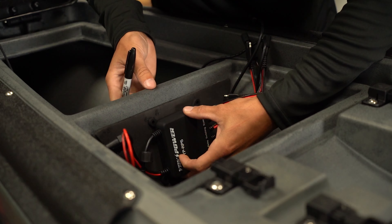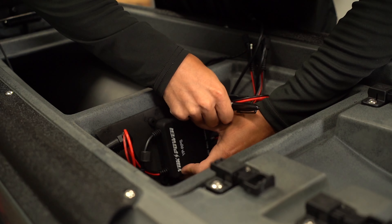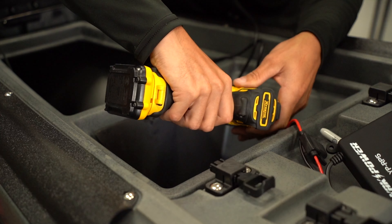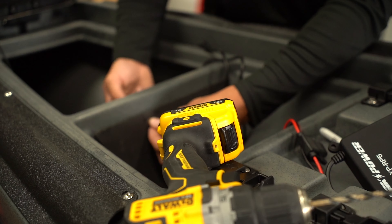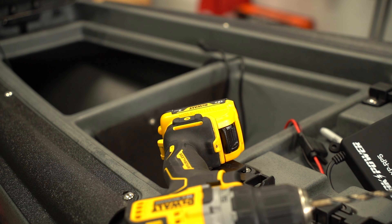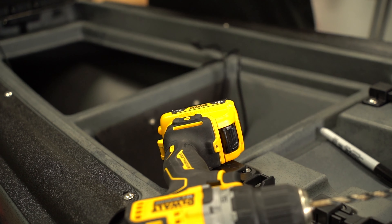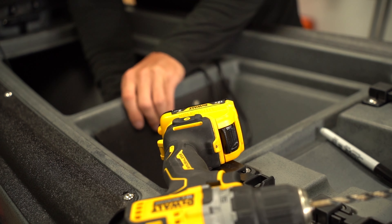Now we're up in the front hatch and I'm laying out where exactly I want this switch panel to go. There was a bit of a challenge here — I wanted the switch panel on the inside to give us enough room for our battery. So I put it on the outside to drill my top two holes, then partially installed the switch panel inside the boat to see where I needed to put my bottom two holes. Then I drilled those out and tied everything together with 10-24 hardware. This gives us a super clean install — we're able to hide the wires inside the hole and have plenty of room for our battery to fit in that recessed hatch at the front.